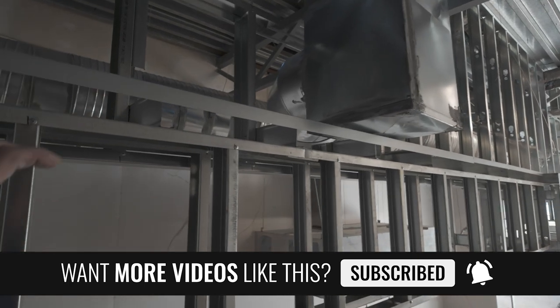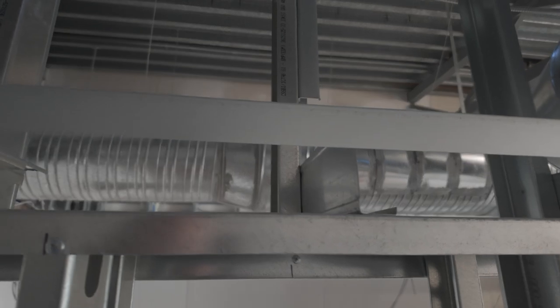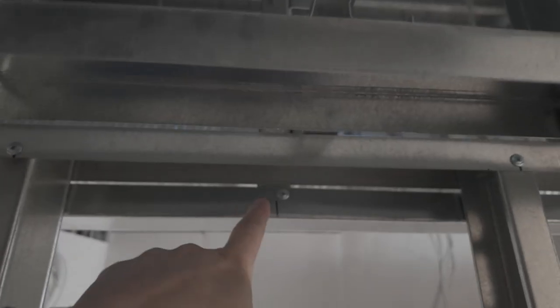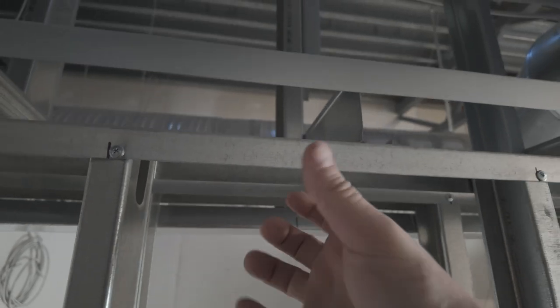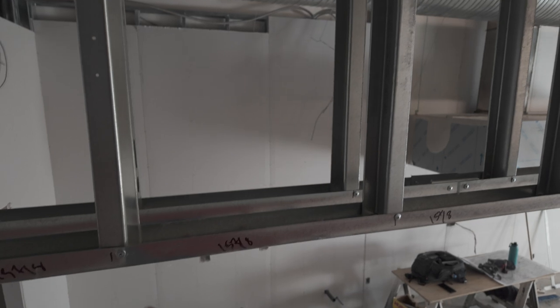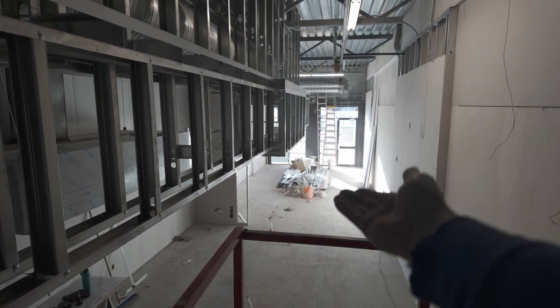Your second step is to set your elevations. On this bulkhead you can see I've decided to drop the first 3-5/8" below the double 2-1/2", so I've come down quite a bit. On the blueprints it would have shown it stopping at that elevation and coming out, but that's not how you'd do it. You need to set an elevation for your back support bulkhead - the 3-5/8" - and then this double 2-1/2" here. You want a consistent top elevation the whole way around, and then this bottom elevation which is not consistent - it goes across, drops four inches, comes back up four inches, and finishes around that finishing wall.